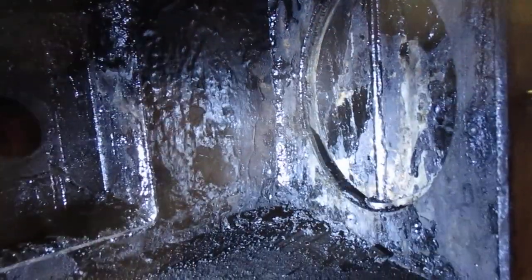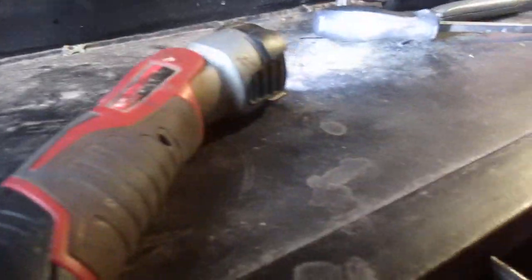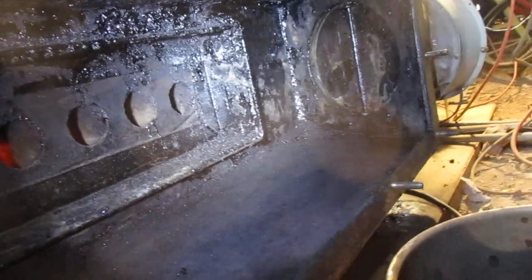That's all the further it opens right now because it's shut. The creosote gets down there, drips down, and got that door so it didn't shut all the way — that's what happened last year when it overheated. The unit's turned off right now and I cleaned all this. I'm controlling the temperature in the boiler through the amount of wood I put into it. It's not the right temperature to work on — it's not hot. This thing just makes a ton of creosote. It didn't do it the first three years and then it started, so somewhere something has happened.